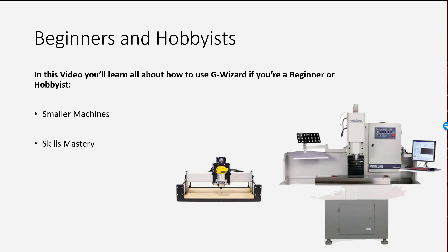Also you haven't mastered the various CNC skills yet. The better you know how to hold down your work, how to aim the coolant or mist, how to do various other things, the closer to the edge of the envelope you can run without having a problem. The pros want to get close to the edge of the envelope, but for beginners you want to do just the opposite — you want to keep back from the edge in order to increase your margin for errors.